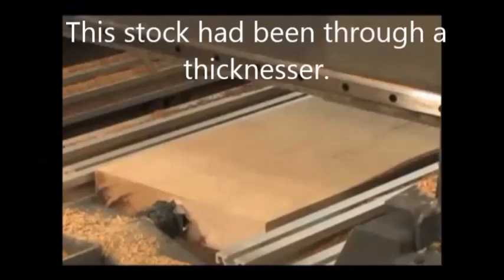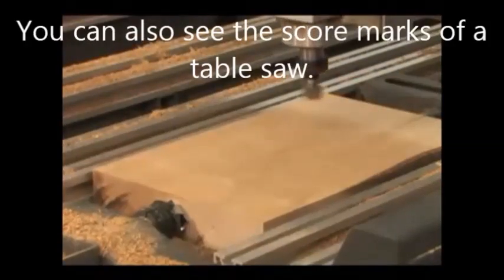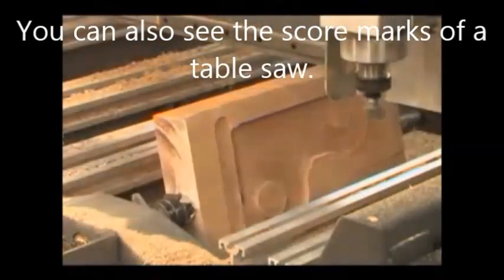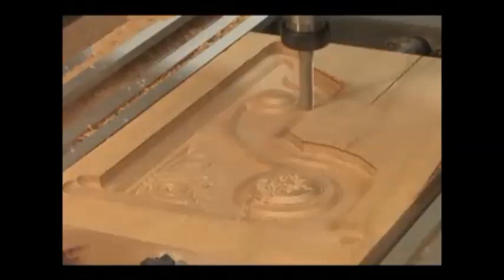It allows you to insert any cutter. The mill will instantly position the cutter over the smart tool and then lower it down. Then we rotate the part 180 degrees using the A-axis and mill a mirror image of the rough. The last step is to cut the part out using a half-inch diameter cutter.